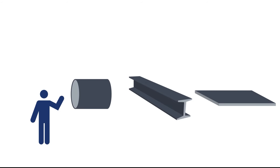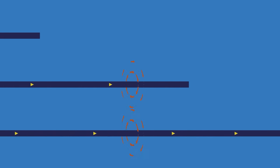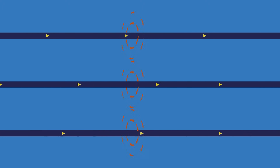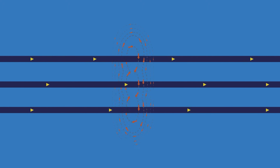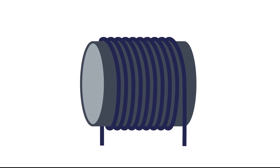When we want to heat objects, we need a strong magnetic field to generate the eddy currents. We can increase the size and strength of the magnetic field by placing multiple conductors with electrical currents flowing in the same direction next to each other — the magnetic fields combine to make a stronger field around the conductors. This is why there are multiple coil turns on induction coils, resulting in bigger and stronger magnetic fields next to the material being heated.